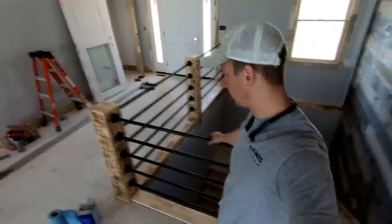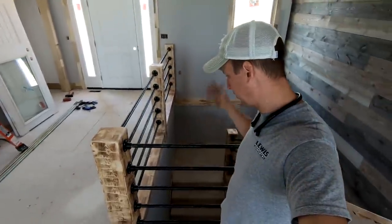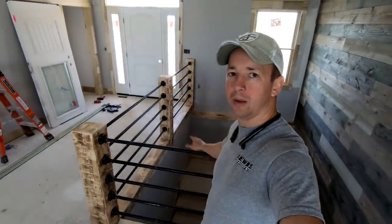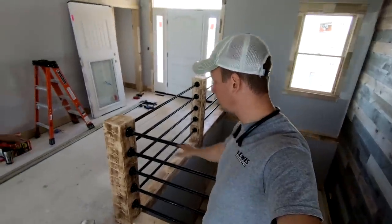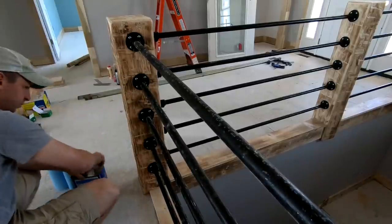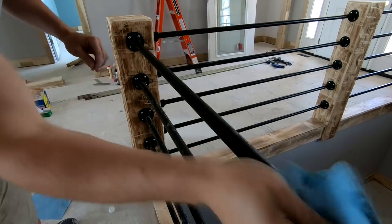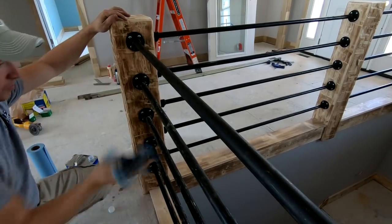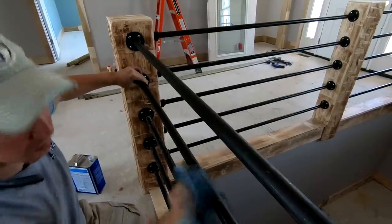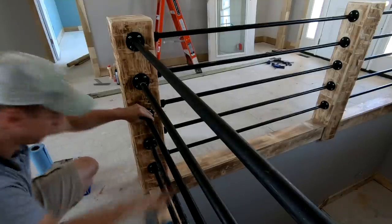A lot of you might have noticed that on this black iron pipe it comes with some painted-on printed writing, probably for identification purposes, but I need to clean all that off. The homeowner is cool with not painting these pipes, but I'm going to hit them all with lacquer thinner to get them nice and clean and get all that paint and dirty nastiness off. The lacquer thinner softens it up, removes that white paint, softens the black paint, removes the dust, and kind of buffs out the finish — it ends up actually being a pretty decent finish after it's all said and done.